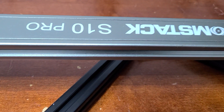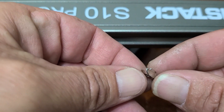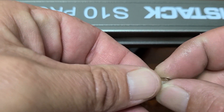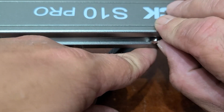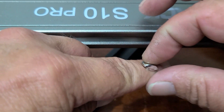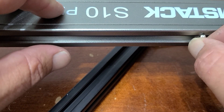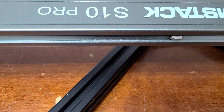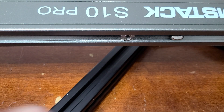Into our channel we're going to stick two t-nuts. If you've not used t-nuts before, here's how they look — you want the small side facing out. Go ahead and stick two inside the channel; they should go right in, but sometimes they want to fall out. We can't slide them in from the end without taking the whole thing apart, so here's another way of getting t-nuts into channels. Make sure they're oriented the right way.